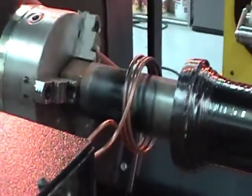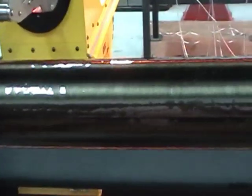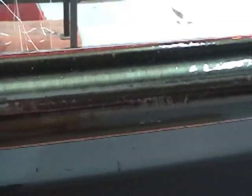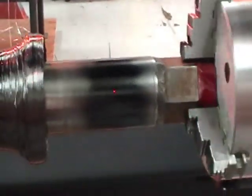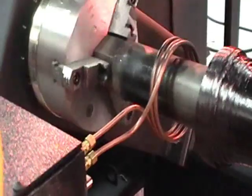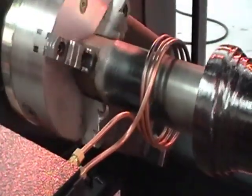The mandrel is now unheated by the induction coil, but the resin within the winding appears to be producing an exotherm. The winding is completely liquid, and the temperatures are 347 on the mandrel at this end, and 351 to 348 on the other end. The time is now 10:45, approximately a half hour into the reaction.